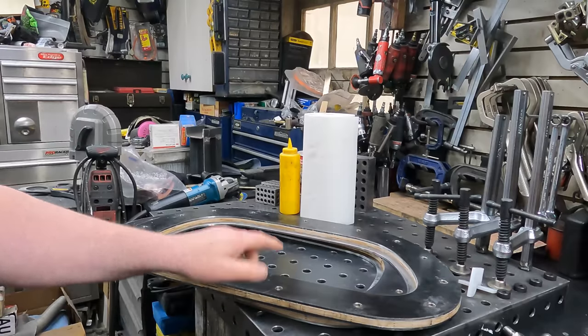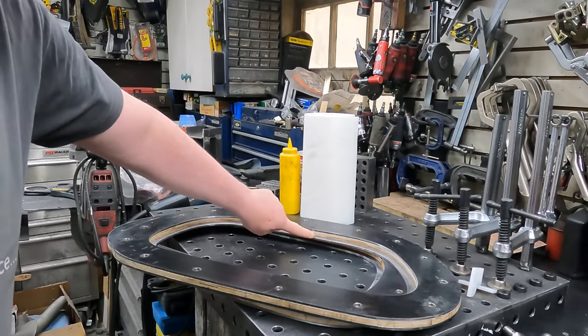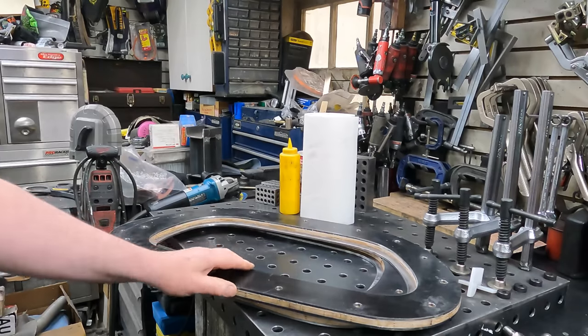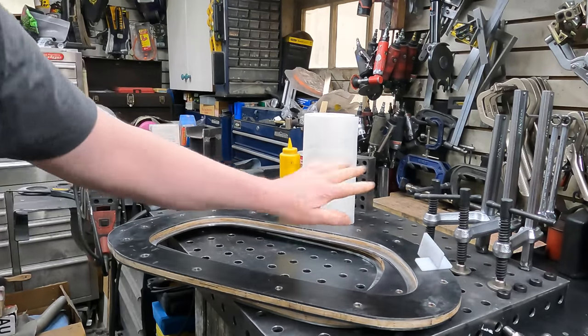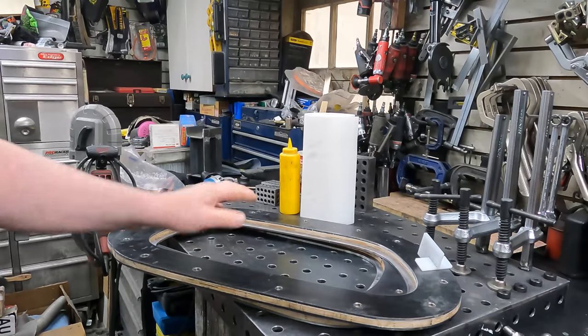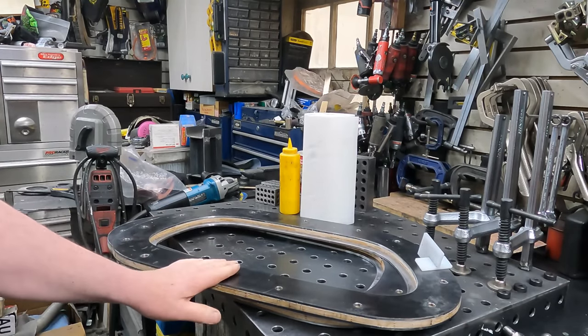All right, with the parts all finalized, it's now time to get the long strand fiberglass body filler put into the groove, and with our tool, smooth it out. But before any of that happens, we're going to get a little bit of wax and grease remover. We're going to clean these things one final time, and then start slinging the Bondo.